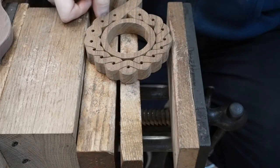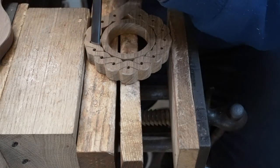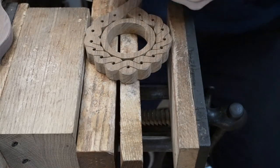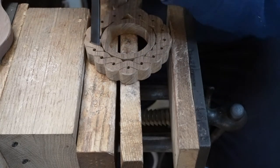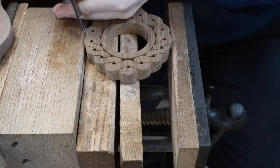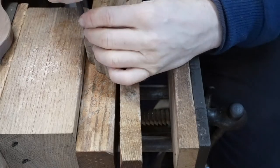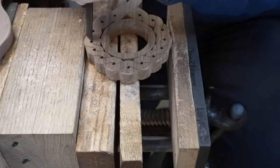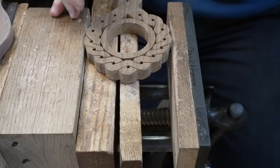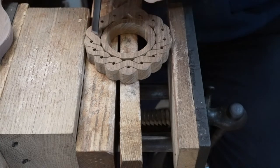I learned with beech. There are a lot of substitutes — they used to sell Iroco as teak. It isn't; there's no comparison. Depending on whether it's been cut radially or tangentially — if tangentially, it can carve quite nicely, but if radially it can tend to be quite splintery. With the Burmese teak, bear in mind where we live — Pembroke Dock — there's a Royal Dock. They brought a lot of teak into the Dock.